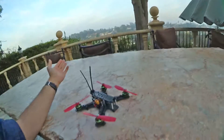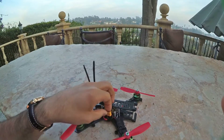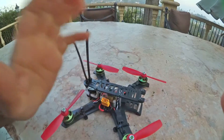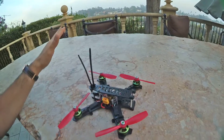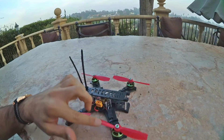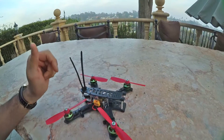The battery plug is tied on to this little tab over here, and that makes it very robust. The battery plug has some movement so that when the battery goes flying, it just tugs out of here real easily. I've also lightened the pins so it doesn't have a really tight fit contact — it stays in fine, but if you're in a crash you actually want everything to kind of explode apart, because it dissipates all the force and prevents anything from breaking. So you want your battery strap to break and your battery to go flying — which is why I don't have any more battery straps. This plug placement is the best design I could come up with — it's the same way that Chad Nowak, Final Glide, mounts his battery plugs, and Mr. Steele too. It's probably the single best feature on here.